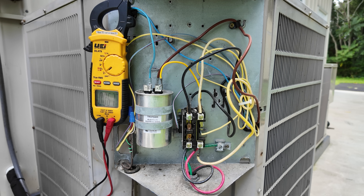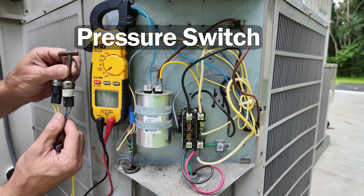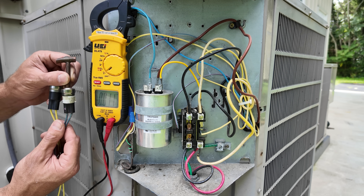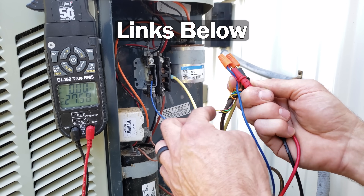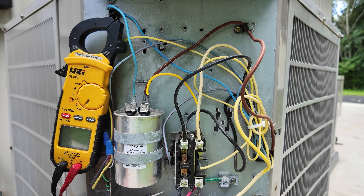You could have a pressure switch that is open, not allowing your 24-volt power to your contactor, maybe because there's a refrigerant leak. I have a whole other video on the step-by-step diagnosis of the 24-volt power and each of these components in the description below. You can and should be diagnosing these components with the high voltage electrical power off, because you don't want to be near high electrical current loads when they're turning on or running, just due to safety.